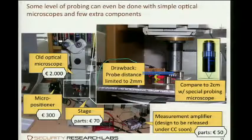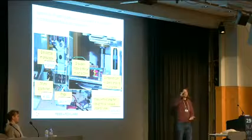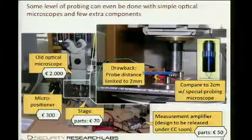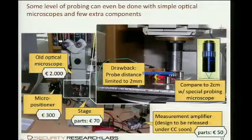Yeah, there's one major drawback we didn't talk about yet. The specialized optics we use on our microscope in the company have a larger lens on the bottom. On an imaging microscope, you have very, very tiny lenses at the end which are looking at the object itself. On the specialized optics, it's different. It's larger, and the numerical aperture, which has an effect on the working distance, is also lower in most cases. On an imaging microscope, it's exactly the opposite, and that is because I have only a working distance of 2 millimeters here.